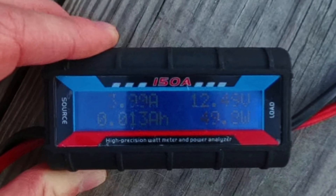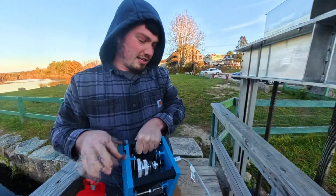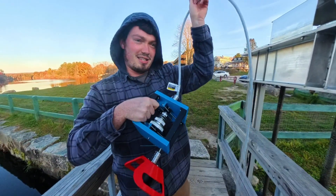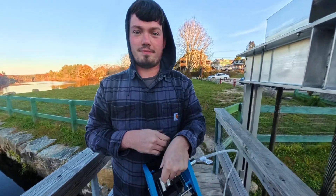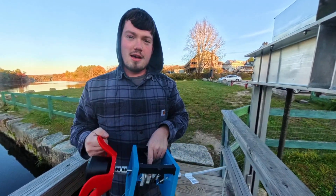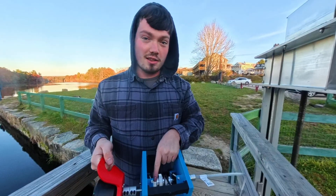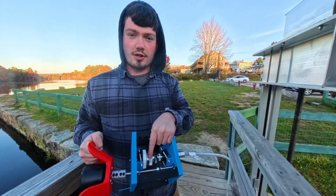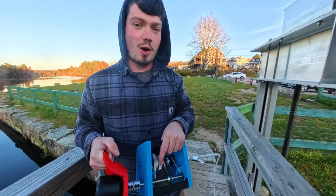Numbers reading 45, 49, 50, 51. So 50? Yeah. This is a bear to hold, but yeah. That's about a 150% increase — we went up slightly in RPMs and gained a lot more power. So we're going to step it up. I'm thinking this is going to be the sweet spot because when you get to that 5 to 1, that's a lot of torque needed to spin this motor over. So I'm thinking when we go to the 80 tooth, which is our next one, this will be our biggest power producer and I think we're going to get over 100 watts.